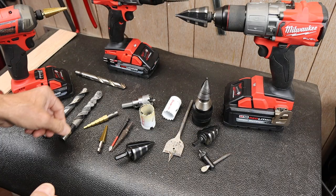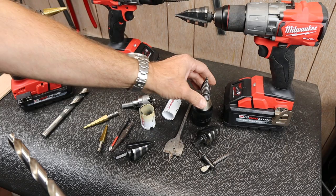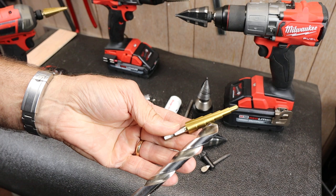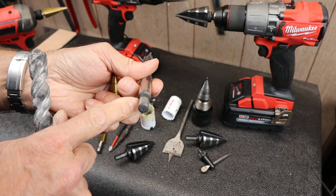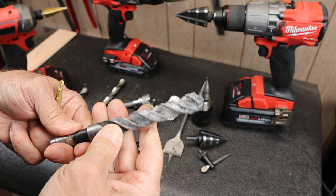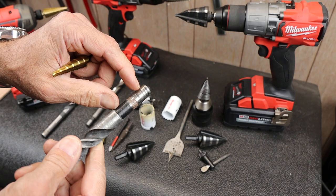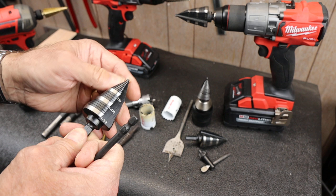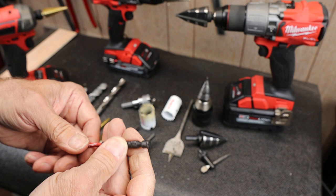If you try to go with a standard drill bit for anything large — even up to seven-eighths, or half inch like this one — you have to start reducing the shank to fit into a lot of chucks. As you reduce it down it starts to get a little absurd that you're driving such a big drill bit with such a small shank. Similarly, making a large step bit that still uses a standard quarter-inch hex is not as strong as you might think.